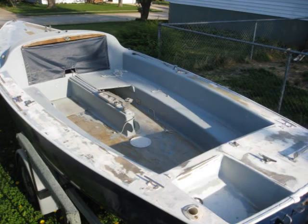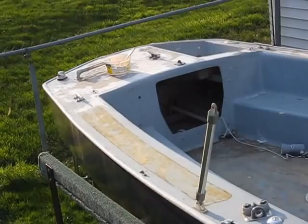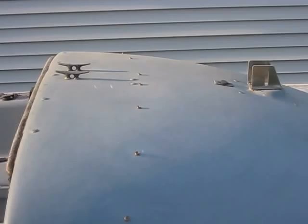I've started work on the boat a little bit. I've removed the vinyl surface paper that's there for grip for the feet — you can see that here. I've started doing some sanding on the boat using an orbital sander with about 60-grit sandpaper. The boat does not have any type of gel coat on it, and what I'm discovering is that it has a coat of primer and then a coat of paint.